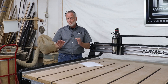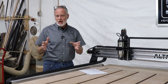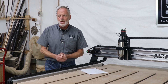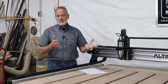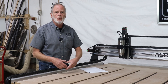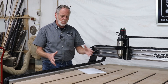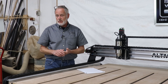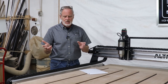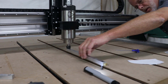Another scenario where you may need to resurface your spoil board on a regular basis is if your CNC router is in an environment with lots of humidity changes over time — say Florida, for example, which has very high humidity seasons and then very low humidity seasons. MDF material absorbs moisture and then releases it, and as we know, moisture over time can make things swell and contract repeatedly and throw off the whole thing. So if you're in a high humidity environment, you will have to resurface your spoil board on a regular basis. You always check first to make sure it's flat — if your spoil board has shifted, you might see that your carves are starting to come out a little bit funny.